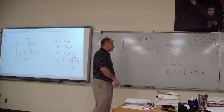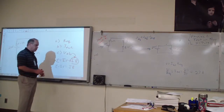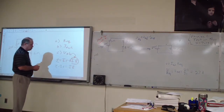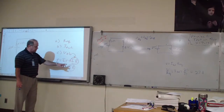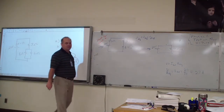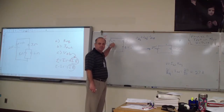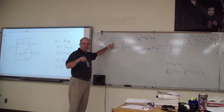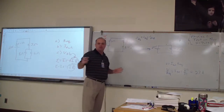So now that I have a total current, let's do that. I just plug in there, and you get your terminal voltage. There's two ways to do this. You can do this minus this, or just do I times R. You don't have that r, do you? What is that r, by the way? It's this plus this. You leave that out, don't you? Why? Because that one's little r, and the other two are big R. Exactly. That's little r. Everything else is going to be big R.